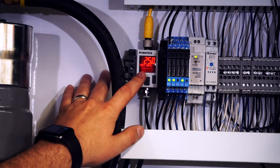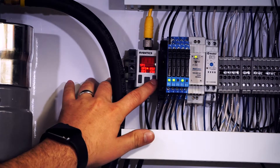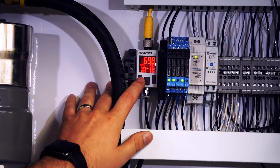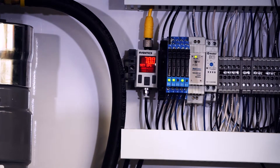To toggle back up to SP1, press the left button. Press the center button to change it down to 70. Once you're at 70 pounds, press the center button to lock that setting in and you're good to go. To get back to the home screen, you can either wait for a 15-second time delay or press the left and right buttons at the same time.